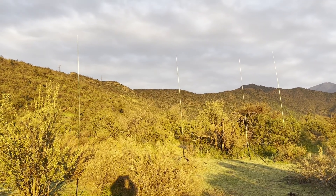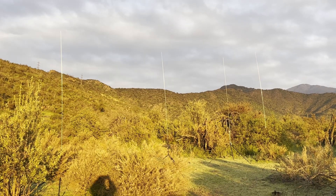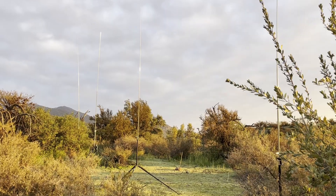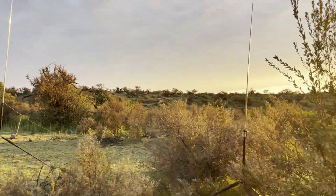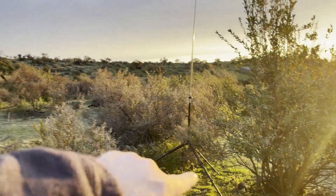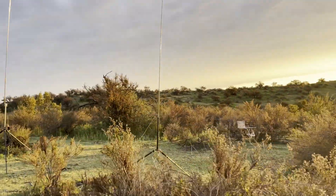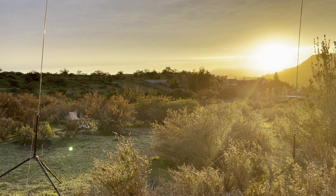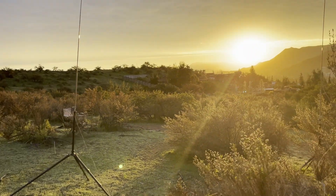I'll tell you what ChatGPT says. The band's just all over the place today, but I've been having fun playing around. I'll walk you through the basics of it. This thing right now has two directors. I've got the radials here that are resonant 180 degrees apart. I've got the first director right there — same thing with radials 180 degrees apart. These are 0.3 wavelengths apart.